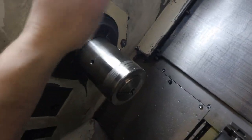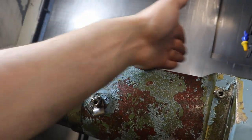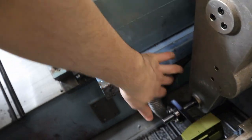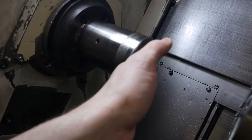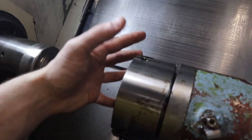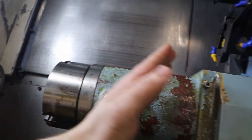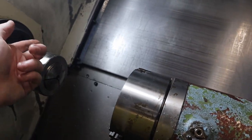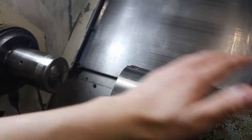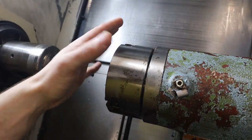So what I did was I stuck a dial indicator on top of the spindle and then locked the C-axis and then swept this back and forth. And it turns out that this would be low. So I would adjust the screws that are behind this thing. I'd adjust it to zero, and then I would come back, put the coax indicator back in, resweep it, and it would be wrong again because when you adjust the back, you're changing the whole dynamic of the thing. So I did that like 9 times, basically coax, adjust, and then the dial indicator on here, adjust the taper, back and forth until the error started to close, and now they're both zeroed out.